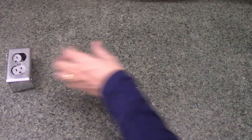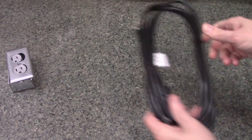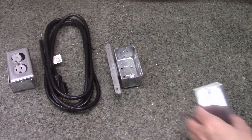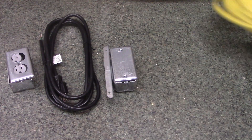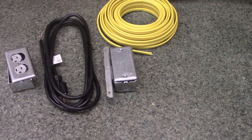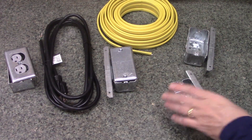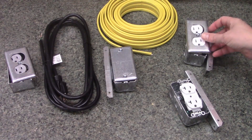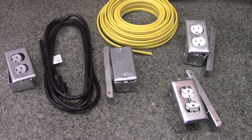Here's how it's going to work. We're going to mount a junction box to the garage door opener so that we can plug into it. Then we have a black 10-foot cord that's going to reach into the attic — this will allow us to unplug it whenever we need to. The black cord will feed into a junction box, and that junction box will feed into house wiring. The house wiring will go to two other junction boxes on the corners of the garage that we will plug the two rotating beacons into. Everything except the first junction box and the black cord will be hidden in the attic.